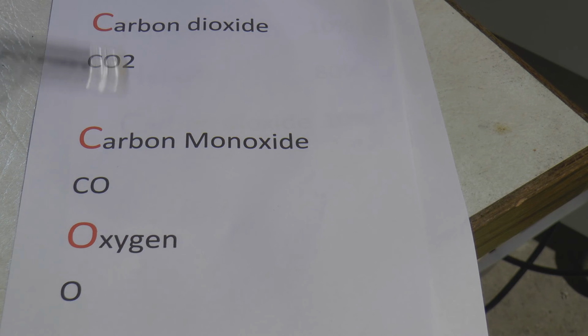and that helps to promote a longer life tube. The principle of a tube dying over a period of time is basically this one, because even when you're running the tube under manufacturer's specified control limits, there is a very small amount of this dissociation, as they call it, taking place. So both the gold and the additional gas, which is generally hydrogen or water vapour, has got a catalytic effect of recombining these two back to carbon dioxide.